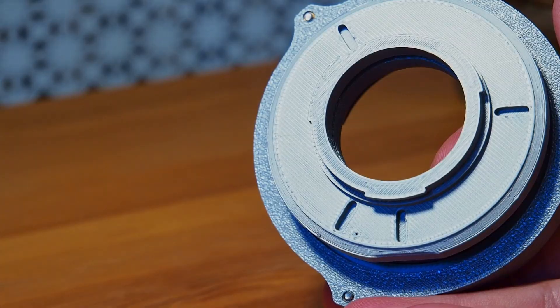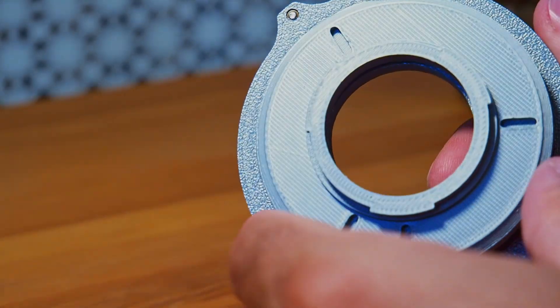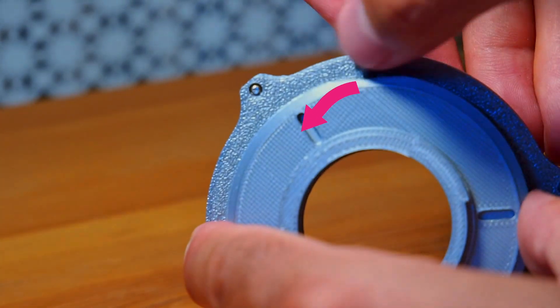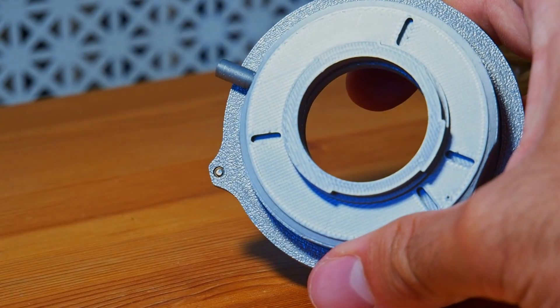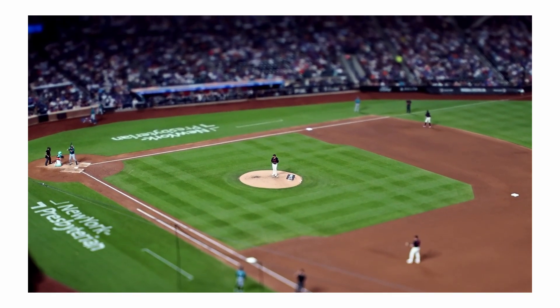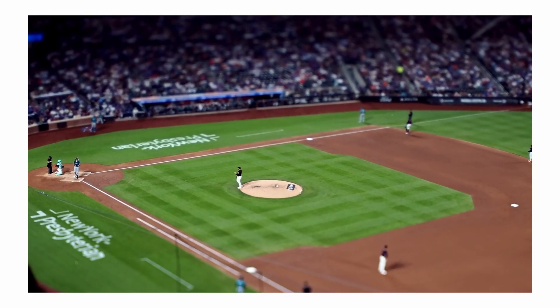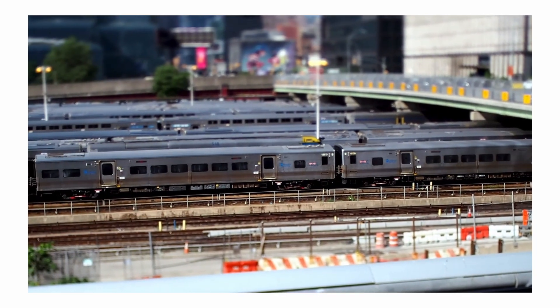The maximum amount of shift allowed by my design is about 8mm. Since on-the-market lenses allow you to rotate the lens to accommodate landscape and portrait shots, I also allowed for this by adding more slots for the pin on the camera body that secures the lens rotationally. This allows for four different rotational orientations, including landscape and portrait modes. I can get away with this since the lens doesn't electronically communicate with the camera, so it's okay to be rotated any which way.